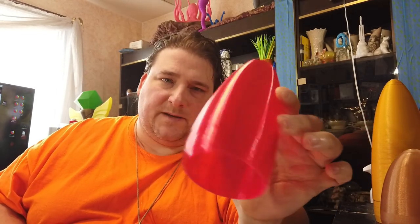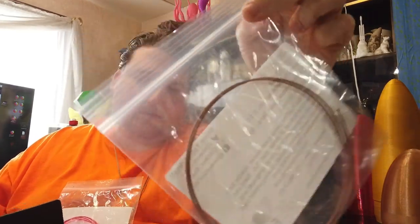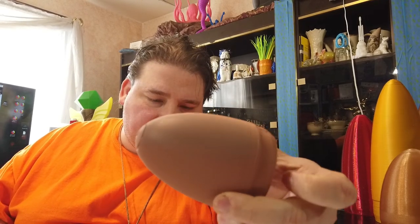I'm betting this will fluoresce. Because this is PETG, I was able to do it completely hollow, which meant I can make a larger nose cone. And what I'm really excited about is from ColorFab — their Copper Fill filament. This one excites me because it's polishable. This thing is stupid heavy too. I made that nose cone with it, and you can see I started polishing it with steel wool. This is going to have a nice copper shine to it when I'm done polishing it.